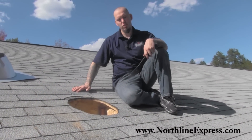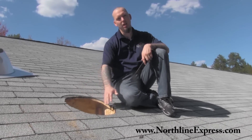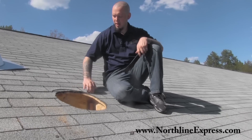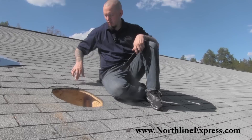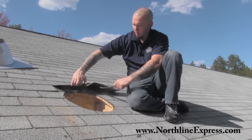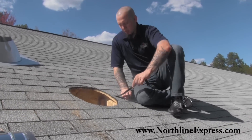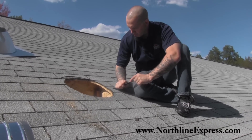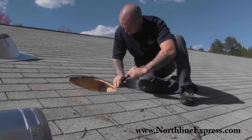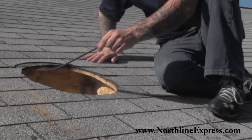We're back on the roof and in this video I'm going to show you how to install your roof flashing. We've cut our hole, our chimney pipe is going to pass through there, and we've already checked to make sure we've got our two-inch clearance to combustibles all the way around the pipe once it's installed. Now the first thing you want to do once the hole is cut is just start to pop some of these shingles up. They are nailed down underneath and the tar line is what holds them down. I like to come about halfway down to help secure it and help it stay leak free, so I'm popping this second row off using a flat bar. It's kind of warm today so you've got to be extra careful because they'll tear easy.